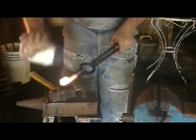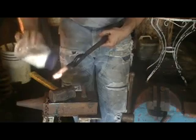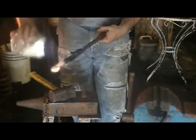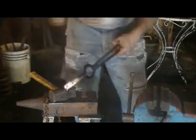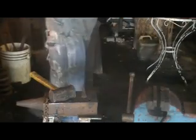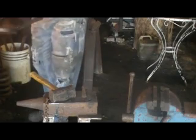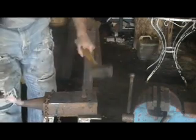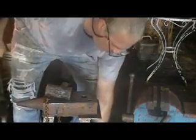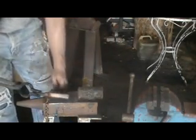onto itself. Put borax. And I use regular old 20 Mule Team borax laundry detergent. It melts at about 600 degrees, which is flat, kind of a black color. Down here in Florida, it's really hot, so we need to put a couple good heavy-duty coats on it. Bring that up to temperature. Remove your hardy, always. You don't want to hit your knuckles on that because it'll open you right up. Not a pretty sight.